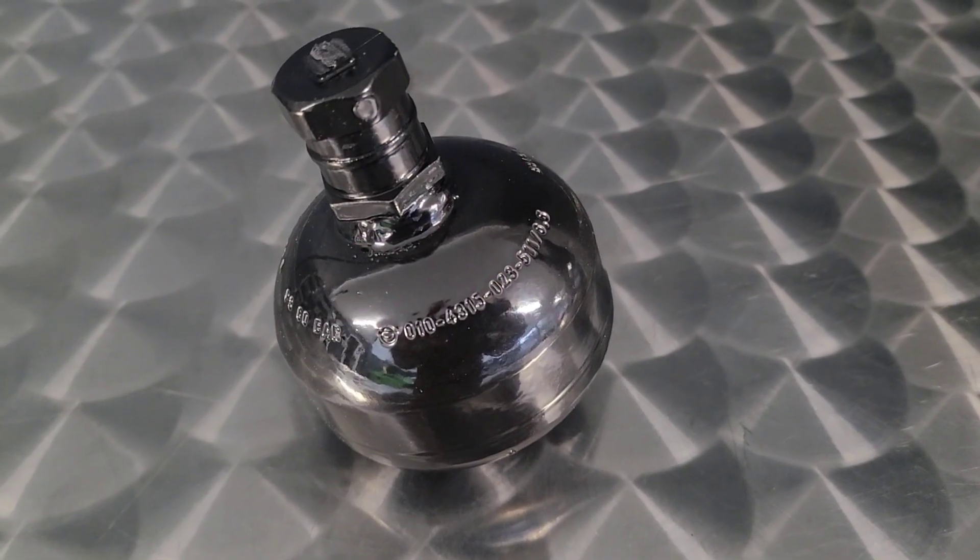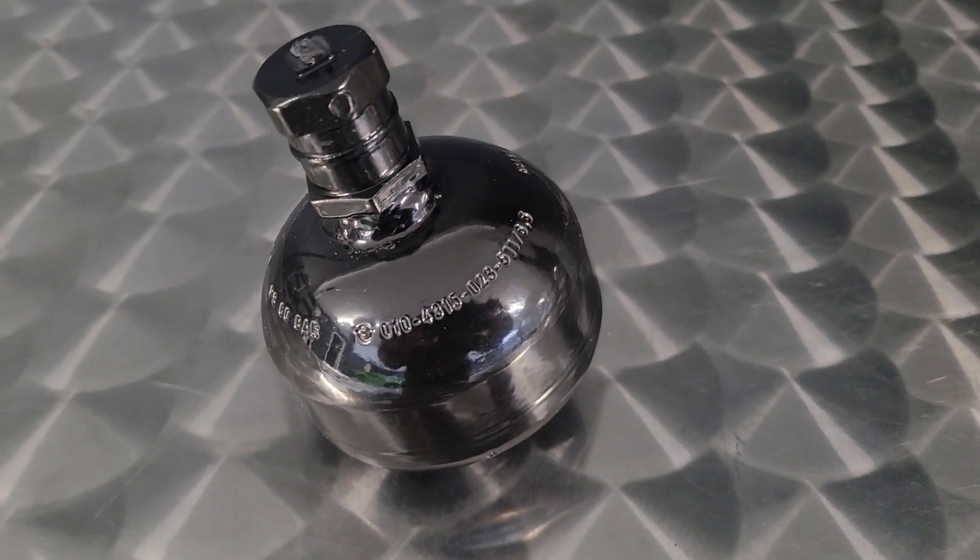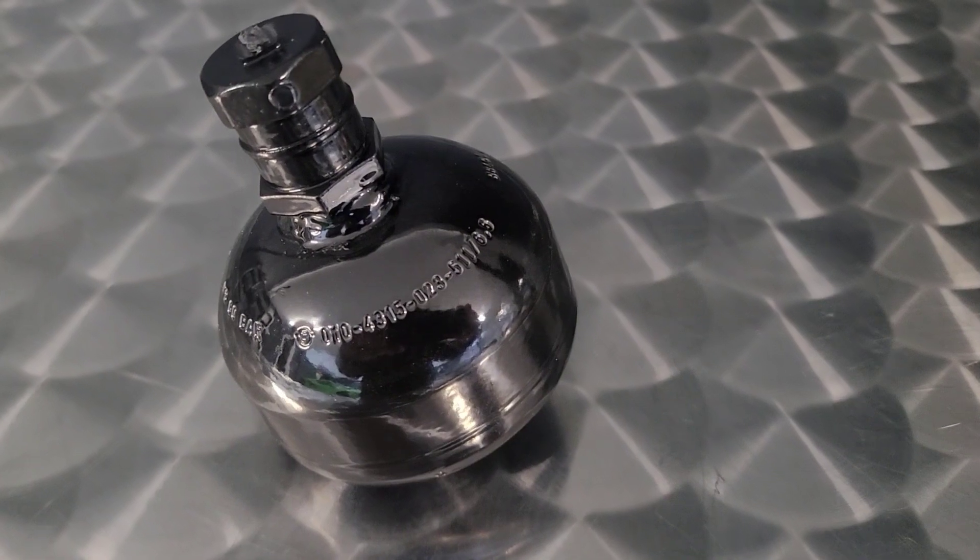Basically, it's a solid little bulb of metal with a diaphragm inside that adjusts according to the pressure required of it. The downside is that the diaphragm inside tends to fail. It's only a bit of rubberized material, so eventually, over a period of time, it perforates and you lose all the pressure. And that's the problem you have when all of your accumulators have failed.